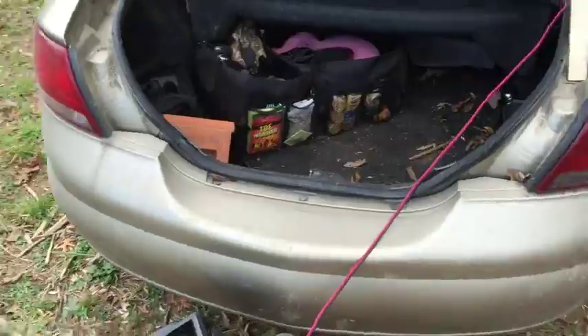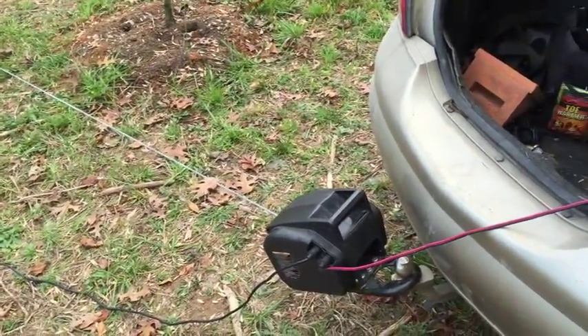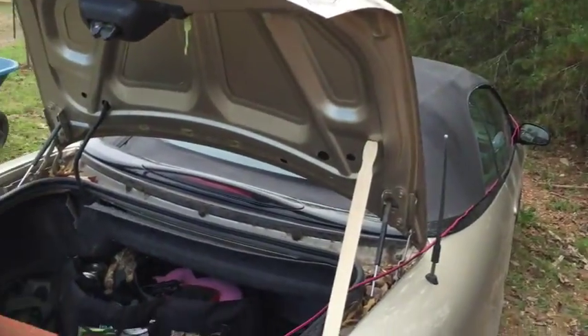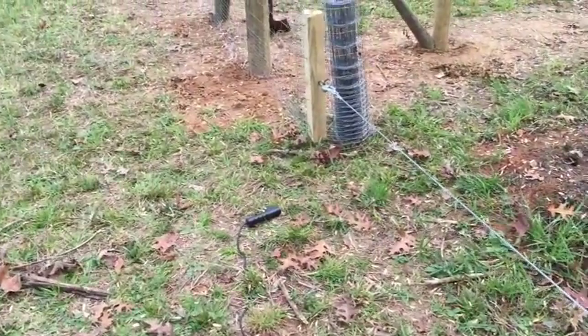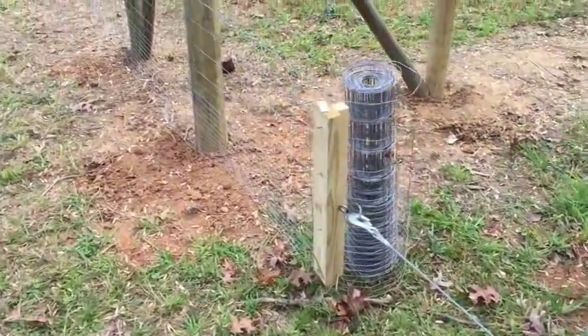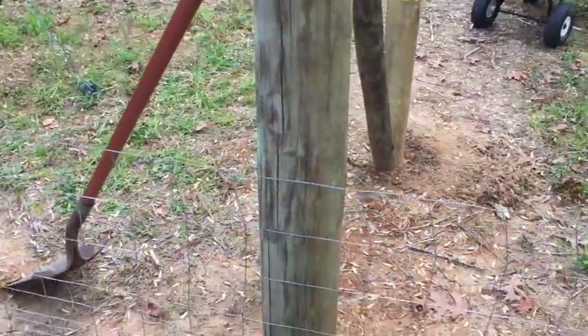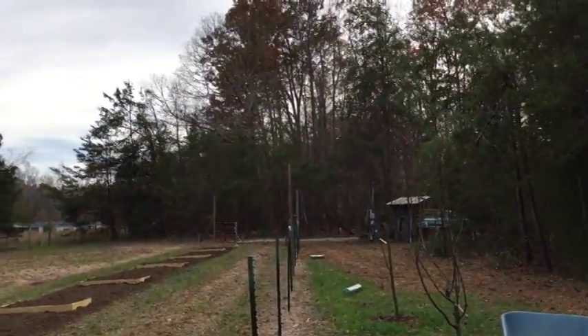You can use it around pretty much anything — I just hook it onto my trailer hitch and then clip it onto your battery up front. It's got a little remote so you can be up here looking at the fence as you're tensioning it. Once you get it tensioned, you staple it and finish unrolling it, then move the car down and pull again.